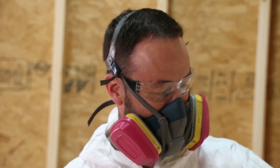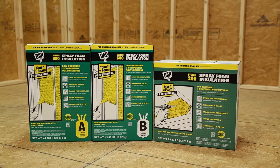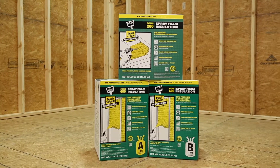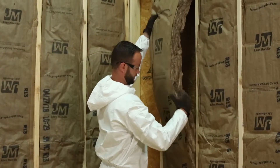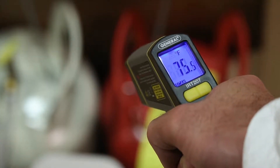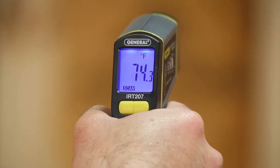Touch and Foam Professional foam kits dispense low-pressure spray foam, so there's no need to vacate the building. But as with all remodeling projects, safety first — make sure children and pets are not in the work area and that you have fresh airflow. Remove any existing batting. Check to make sure the tanks are at 70 degrees or warmer and that ambient air temps are above 60 degrees.